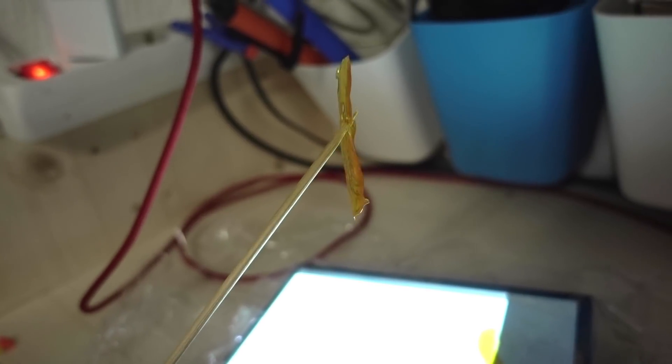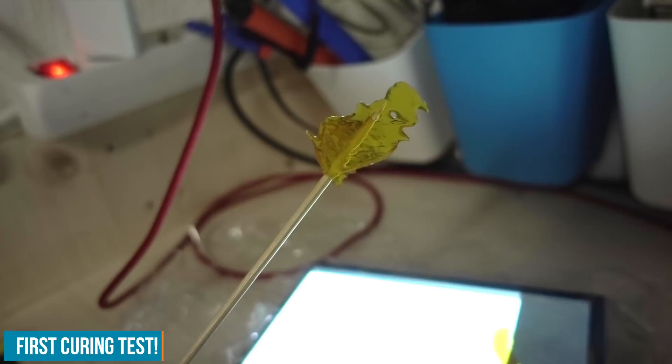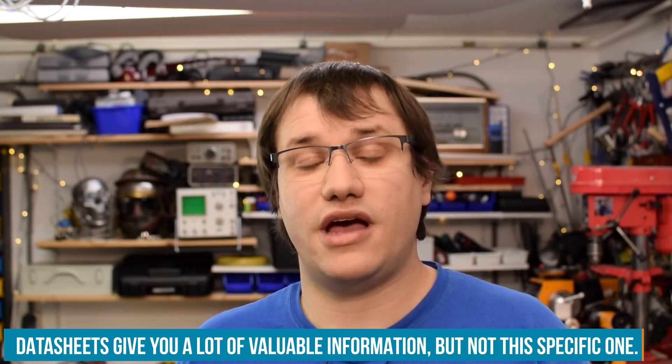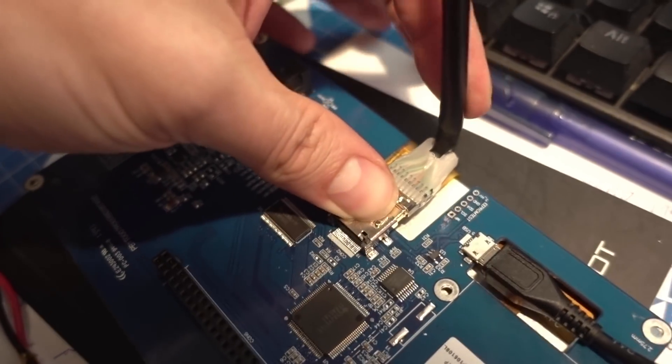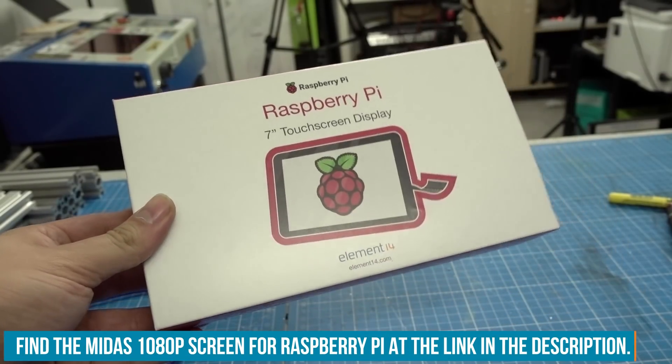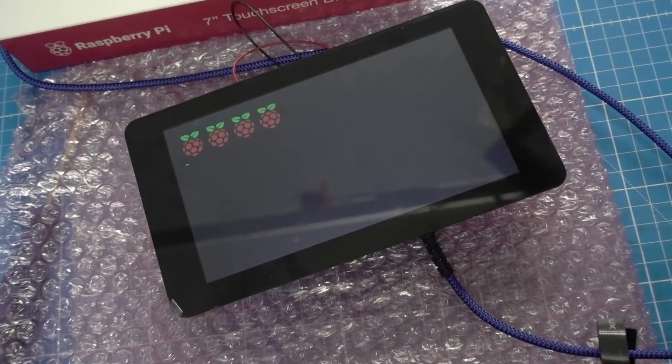It turns out that some suitable LEDs are built into commonly available LCD touchscreens or regular LCD screens. My biggest challenge now is to find screens that are suitable for the project — let's give it some trial and error. I searched through tons of data sheets to find the wavelength of the LED backlights, and I couldn't find anything concrete. In the end it's basically trial and error. So I'm using a Midas screen and also the official Raspberry Pi display, because that screen works perfectly with the Raspberry Pi and also with NanoDLP, and it's the screen everybody out there should be able to get.